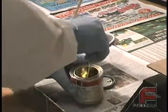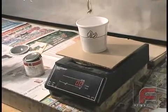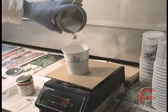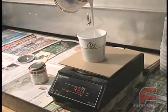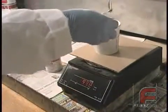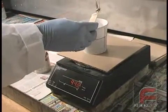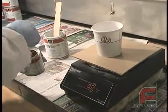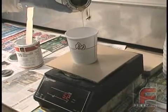The mix ratio we're following here is 100 parts resin to 14 parts hardener by weight. Once we put the lined cup on the scale, we zero the scale and then pour 100 grams of the epoxy resin in the cup, using a paddle to add or remove material towards the end since it is easier to control. Most uneven ratio materials are much more sensitive to their ratio than a 1-to-1 system like Repro, so we want to be within 1% of the required ratio, which is why we are using an electronic scale. Once the resin is poured, we re-tare the scale to zero and add the hardener directly on top of the resin. It is important that you don't use a separate cup for the hardener or you may lose too much material when you combine them.